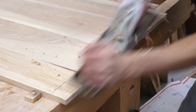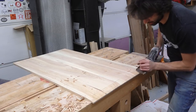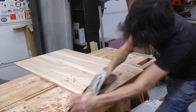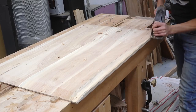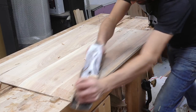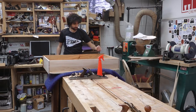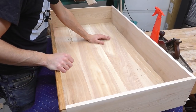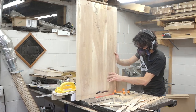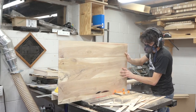First off, I had to do all of the drawer bottoms and I did that two different ways. The first way I did with hand planes because that way is just a lot of fun. It's a good way to practice using hand planes and it's actually pretty quick if you're only doing like a couple of drawers — four or less. Just creating a bevel on the edges of the panel to go into the drawer boxes themselves. It's not something that has to be super precise, just a wasting exercise to get the waste out of the way so that it fits into the drawer box. I ended up doing that method for two of the drawer bottoms, and then the rest I did on the table saw by running them vertically against a tall auxiliary fence and beveling them that way, which made the process of beveling the other nine drawer bottoms quite a bit faster.